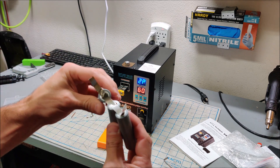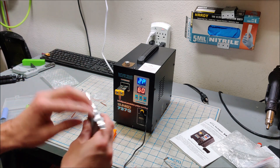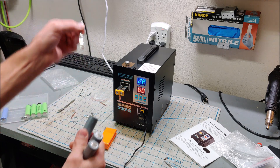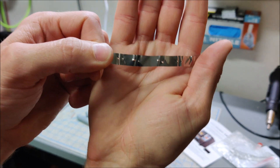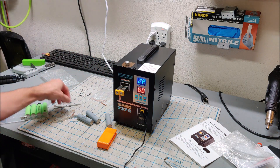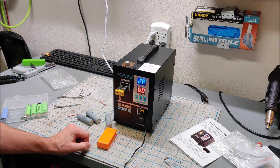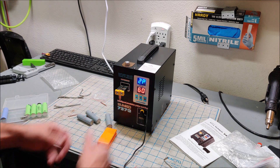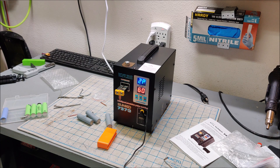That is spot welded, and this is the thicker 0.15, so no doubt it'll have no problem on the 0.1. The nickel actually ripped off those spot welds, so the machine does spot weld the 0.15 just fine. I plan to do some modifications to get a pen going because it's pretty awkward putting the battery there and using the foot pedal while standing. But yeah, this was right at about a hundred dollars, and I can't argue with that.